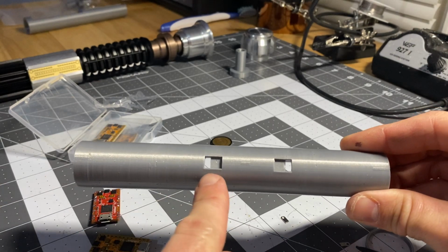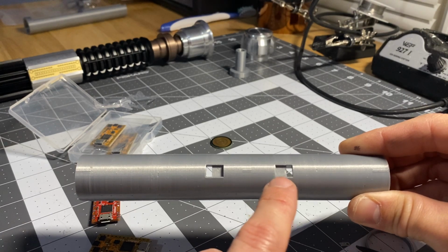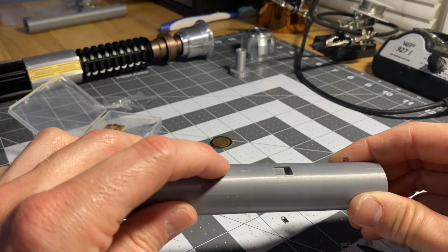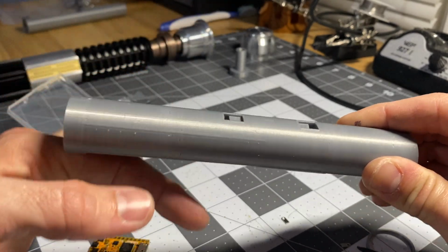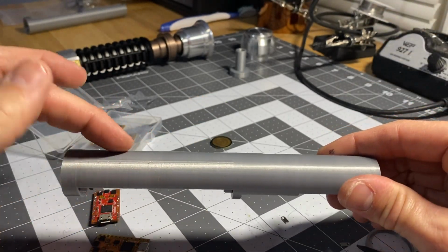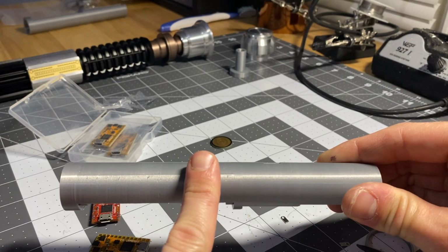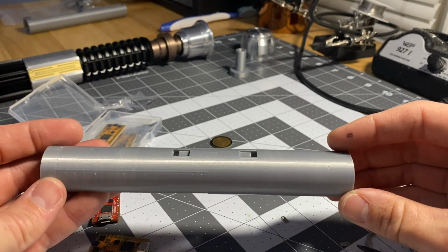Switches, okay, go on this side. The switches part go towards the inside with the wires running to the outside to the holes, okay? You'll use a little tiny dab of that E6000 there to hold your switches down. Once I put the glue there and the switch, I use blue masking tape, and I'm just gonna wrap it around there and make sure it's pressed all the way down flat, and then I'll leave it alone and let it dry. You wanna make sure those switches are sitting down low enough they're perfectly flush with this chassis. If they're sticking up at all, then they could catch whenever you slide your hilt in and out. So you gotta make sure they're sitting all the way down, okay?